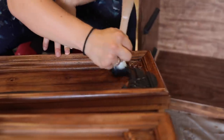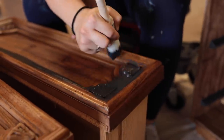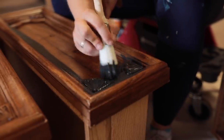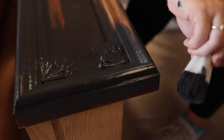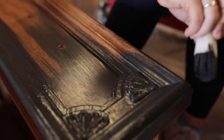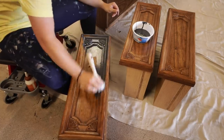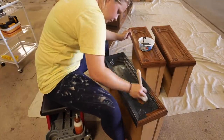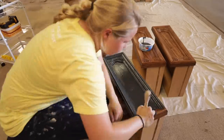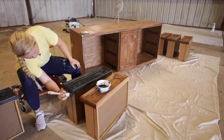It's time to paint. I'm going to start with the details. It's going to be a little tricky because I don't want it to pool in there, so I'm going to use less paint in those areas so that I don't get pools. Like I said earlier, this paint has a built-in primer, so we won't be needing to prime. This should stick right to it. And since this is not real wood but instead plastic and laminate, it is going to be free from bleed through.